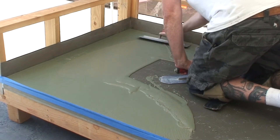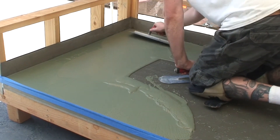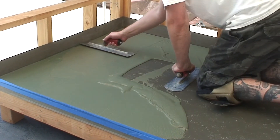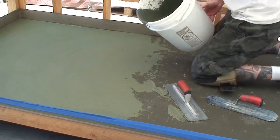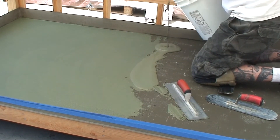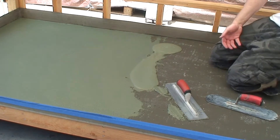Using a paintbrush wet with water, spread slurry coat into corners and feather all outside edges to zero. Use a square trowel for the edges and a rounded pool trowel over the main surface of the substrate. This will help achieve a uniform finish.